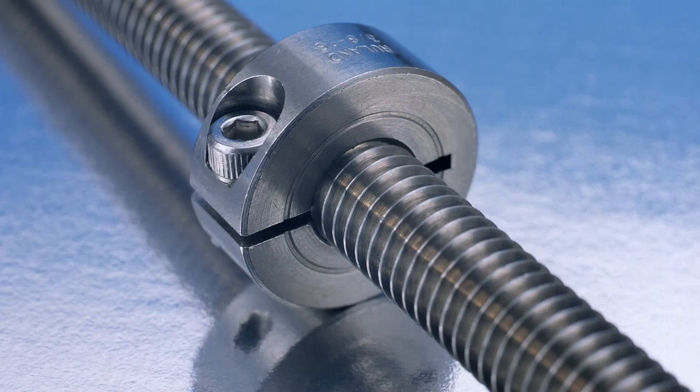When it comes to threaded shafts like this one, the shaft material and quality of the shaft threads make a big difference in how the collar performs in the application. Since the threads of the collar are female, they have more material supporting them than the male threads on the shaft. The threads of the collar should not fail before those on the shaft. When specifying a collar for this application, the engineer would need to know what the anticipated axial load is going to be and whether or not the threads on the shaft itself are able to hold that much load.